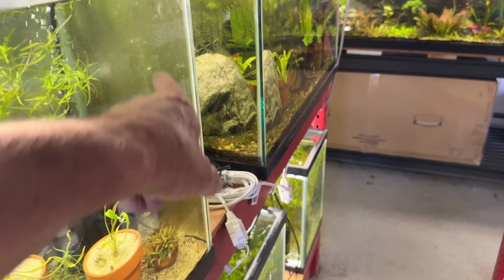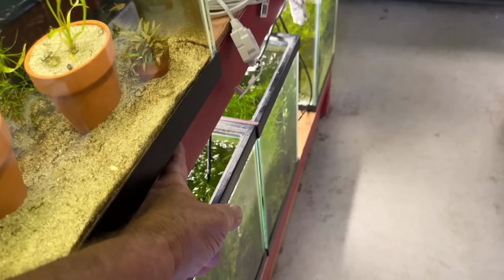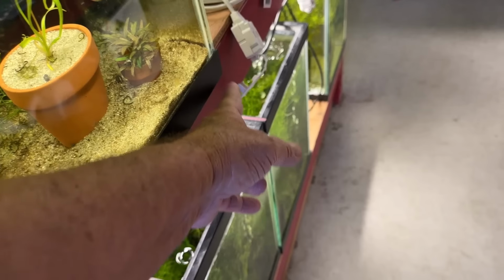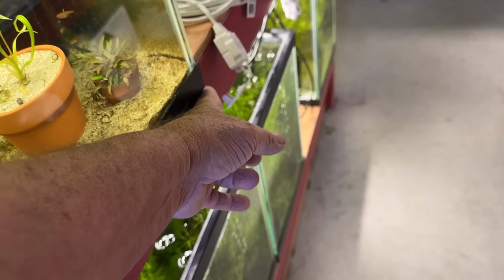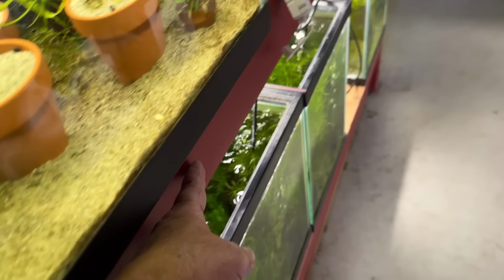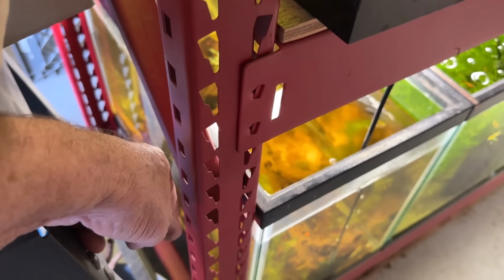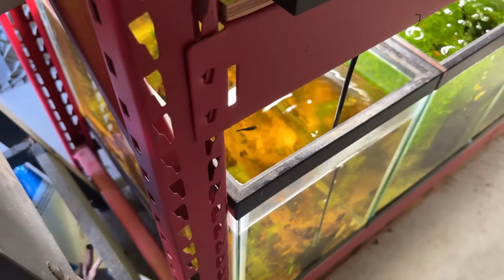On these two 29-gallon tanks, I'm going to run a hose or a piece of pipe down inside, from the inside up and over to the outside, down to this metal rack here, and I will put a valve down here. I can open to allow water to come out. I'll show you how we charge it all when we get to that point. And that will come down this way and go out around the corner, down to where I'm going to tie in the garden hose to drain.